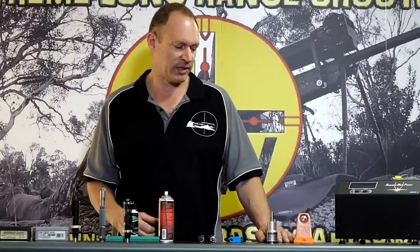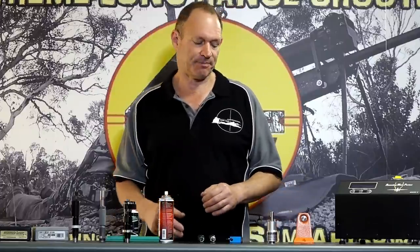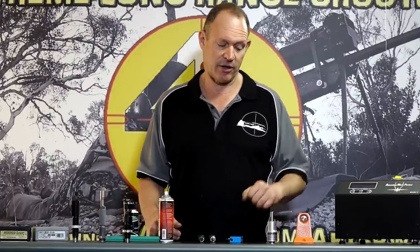And I don't do it all the time anymore. A little bit time is money, but a little bit I wasn't really seeing any real gains out of taking off 2 thou or 3 thou and that sort of stuff. I measure to see if I've got proper growth. If I've got decent growth, then I need to keep it in check, then I come back down. But otherwise, I probably would only trim every 3 or 4 times. I'd go through and trim and do the deburring, all the rest of it. Like I said, whether there's a good logic or a bad logic, I tend to prefer to trim over the full length of the case rather than the shoulder on the case. Should end up with very similar, but that's what I do.